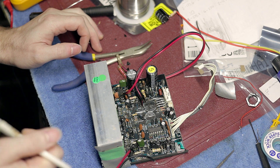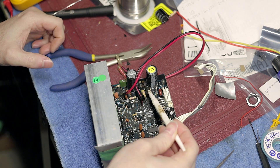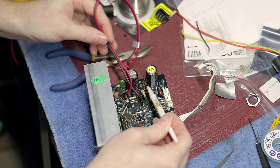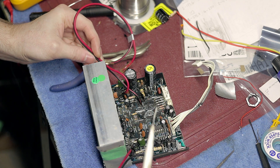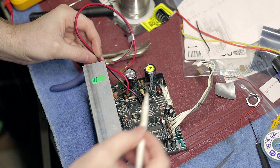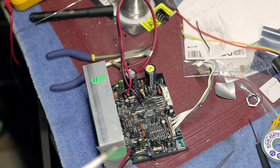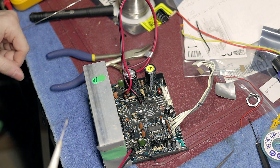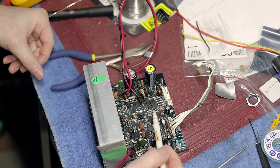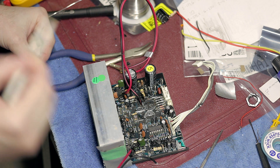I've got a couple more jumpers here to replace. Up over here on the power supply, this 2K resistor is a very common problem. This one commonly heats up a little bit and it sort of bakes that compound, and then the compound becomes almost like an insulator and seems to trap heat. You can see, even on some of these components in here, where they were heating up and it was actually causing damage. This potting compound is even down in these diodes, down in the through holes for them.